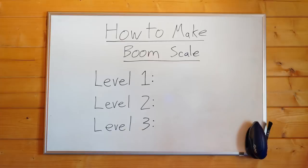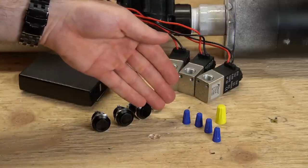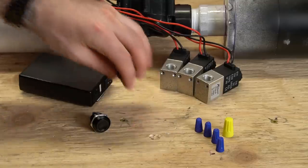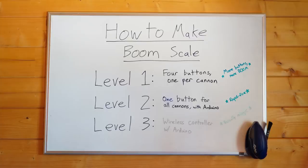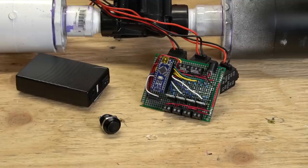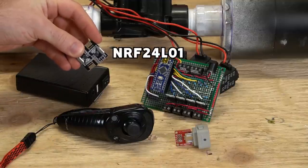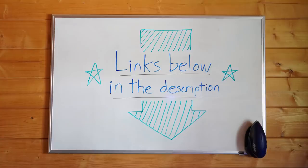Next, we need to test all the cannons together with our completed electrical system. Decide how you want your launch to operate using the following scale. Level 1: four individual buttons, one for each cannon. This is the simplest design and does not involve an Arduino or any coding — with some wire nuts you can even avoid soldering. Push a button and boom. Level 2: one button to rapid fire all cannons. This involves an Arduino and some code, but does not require a wireless controller. One button rests on the back of your launcher — press it for glory. Level 3: a wireless controller programmed to fire one or more cannons. This is what we've done with the R0M4. Unfortunately, this particular controller has been discontinued and is difficult to find. If you're up for the challenge, you can make your own controller using an RF module such as the NRF24L01. Designing a controller with an RF module is outside the scope of this video, so check the links in the description for our suggested channels.